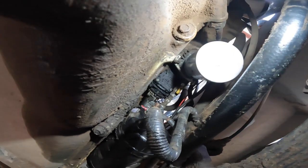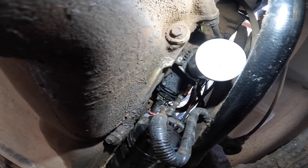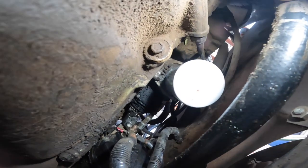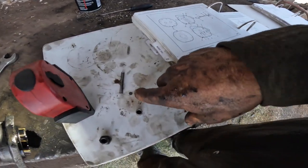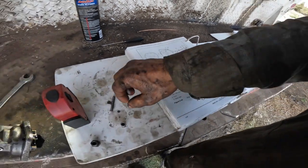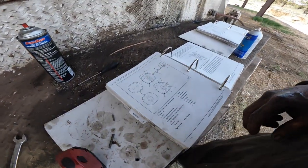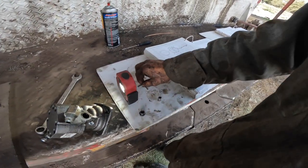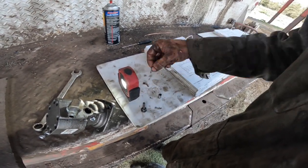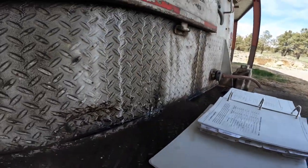It looks like they had that out of there. That almost looks like the old one. I'm going to pull that out of there and see if that valve is stuck open. So here's the relief valve. It was assembled correctly. There's a little spacer, which is that little button right there. That goes in the plug like so. I've already brake cleaned this stuff off. And that's a little bitty bastard. And then 16 is obviously going to be the O-ring. And then the pin, well, you would stick the spring on there. And then stick the pin down there in the hole. Now the wind's going to blow the opposite direction. You son of a bitch.